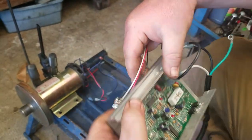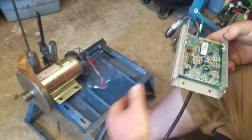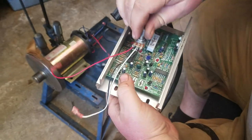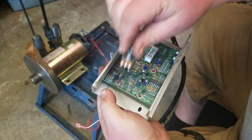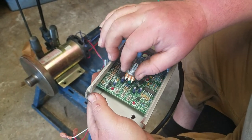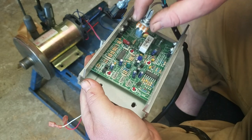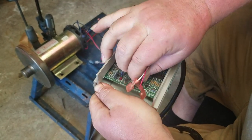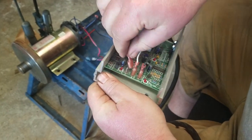The potentiometer — the way to figure out which way to wire it is: hold it so all the prongs face this way, with your black and white wires over here. If you turn it so the prongs face the opposite way, it basically wires that exact right there, wire for wire. Your black goes in, white goes in the center, and your red is on the end.